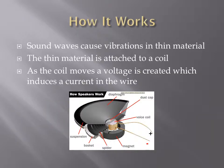How this demonstration works: in general, these speakers are essentially like dynamic microphones. The way these speakers work as a microphone starts with a sound wave vibrating a thin material located here. This thin material is attached to a coil, shown here, which is suspended in a magnetic field due to this magnet, shown here.